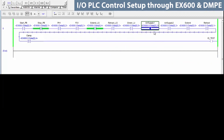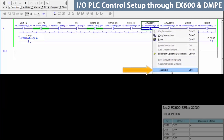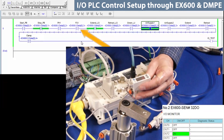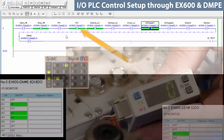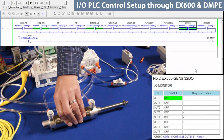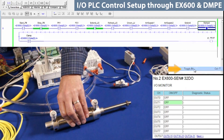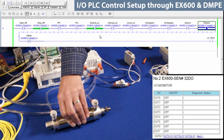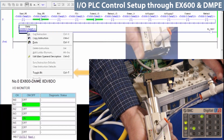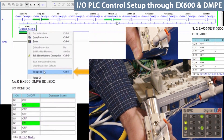To activate the flow switch bit, toggle the output bit to the valve controlling its air supply. Then adjust the speed control until the flow switch reads 60 liters per minute — the flow switch input bit should turn on. To move the actuator, we need to turn on the extend output. Toggle the bit to extend the stroke and then again to turn off that bit. To return the actuator, turn on the retract output. Next, we can adjust the clamp output. Notice how it changes from the extend to retract limit switch by toggling the clamp bit.